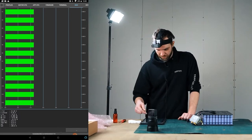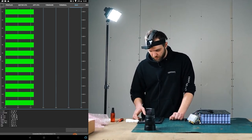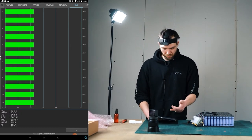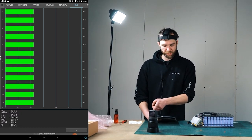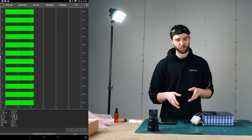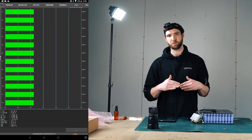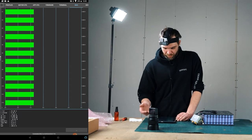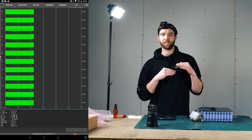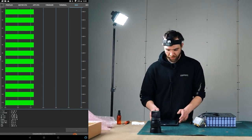That 0.001 difference can be a bit of false information because the real test is how stable the group is once we charge and discharge. You're going to want to watch each cell as it charges. If one overtakes a cell and that overtake continues to progress as you're charging, there's a problem with that group. It's best to stop charging - don't let your cells get too out of balance, because you're going to need to either discharge them or charge others up to bring those back in line. The same applies with discharge. But if you notice one jumps up say 0.1 and then keeps that steady - the gap never increases - then chances are that cell is good. But it's always a good idea to keep an eye on it.